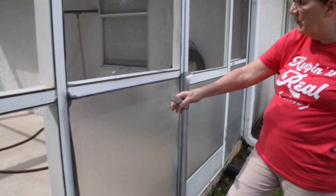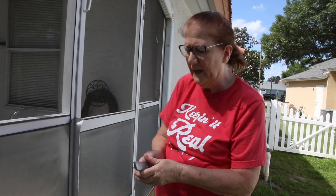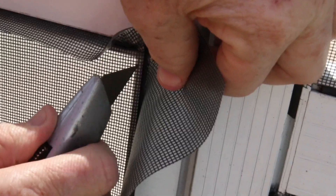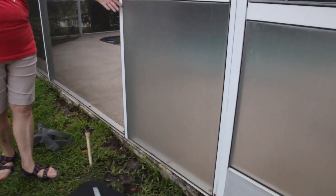The last step: as you can see, the screen is in place and it's nice and tight. It went in very easily. Using a box cutter, cut away the excess screen — put it on the outside, make sure your blade is sharp, and just cut right against the spline. Then you just go along and cut right up against the screen all the way around.